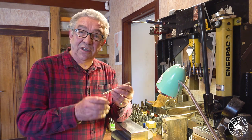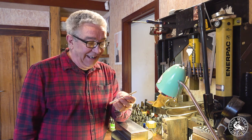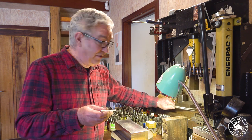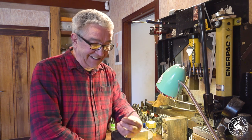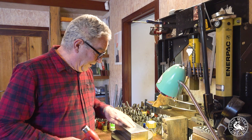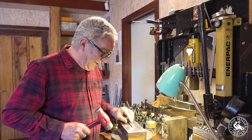Today I'm going to be showing you how to make a forged silver bracelet — this is a sort of how to do a quickie on it. I've cut this piece off a larger piece of six millimetre round silver wire, that's about not quite a quarter of an inch. I'm going to show you how to get through this nice and quick with a big hammer on a polished steel block. I've polished my steel block and given my hammer a bit of a dress so it's not too grungy, and away we go.